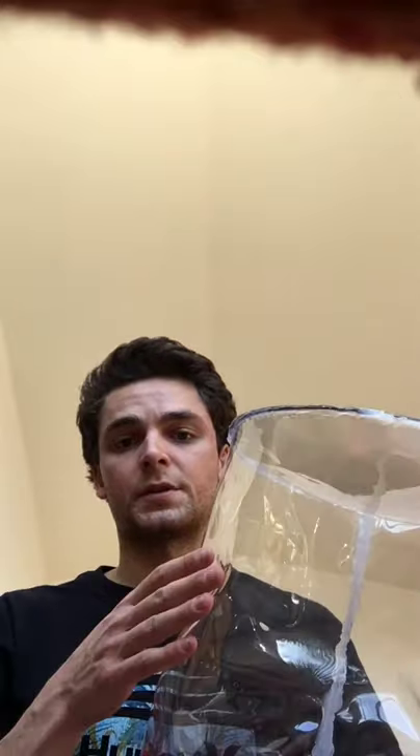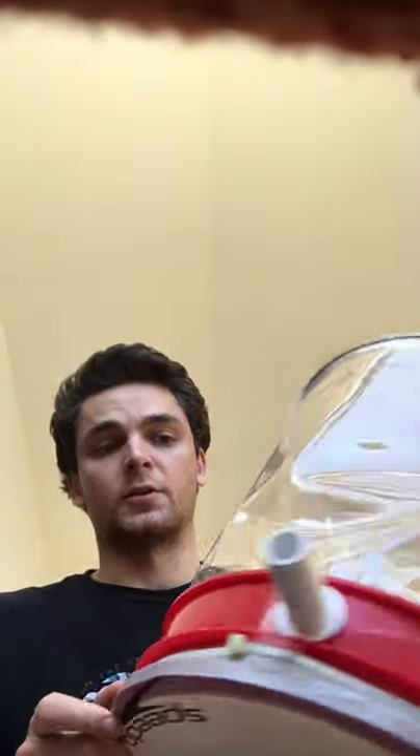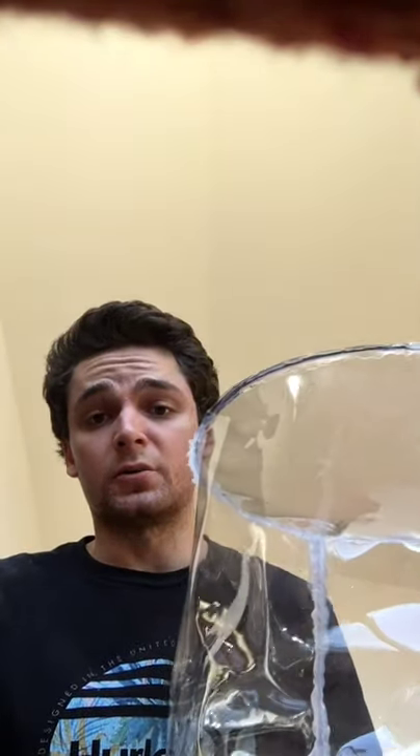The materials you are going to need: I purchased a clear PVC film, which is this portion, and I bought it off McMaster-Carr.com — I got 0.016 inch thick. You're also going to need a five-gallon bucket, a swim cap, and zip ties. You're going to need to either 3D print these parts — I will put a link to the STL in the description — or alternatively go to a hardware store and purchase these as PVC fittings. As far as tools, you're going to need a glue gun, a jigsaw, and a drill.